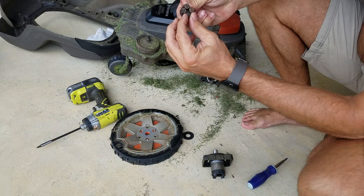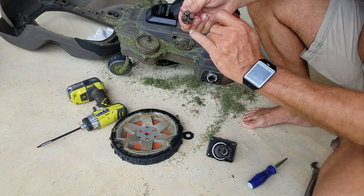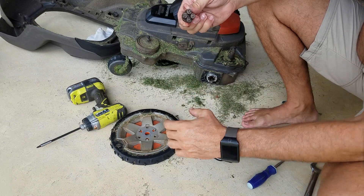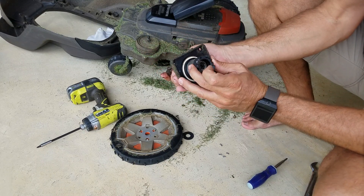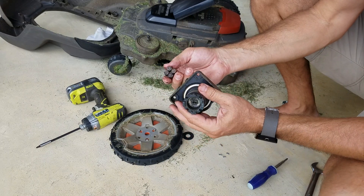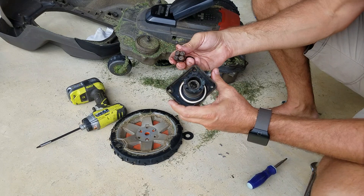These are plastic gears on a metal pin — they spin on a metal pin. The inner ones are another set, and those are metal gears on a metal pin, but the metal pins were completely wiped out so the gears are flopping around and have a hard time engaging with the outer ring gear. Getting those apart is not really serviceable — you can't just get the individual gears, which is unfortunate since the motor is still perfectly good. I'll more than likely call Husqvarna because this is still under warranty.